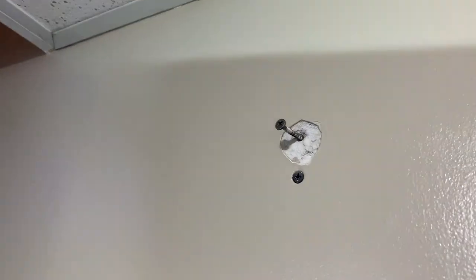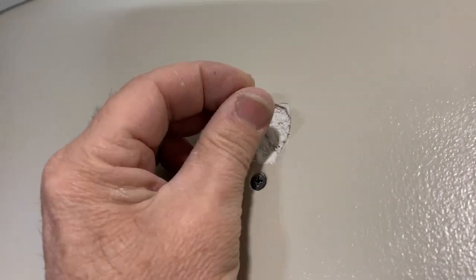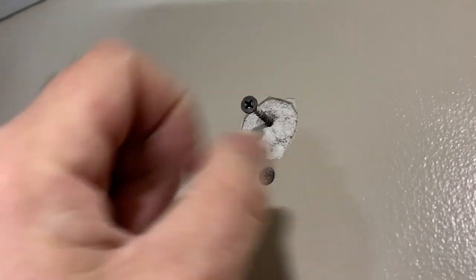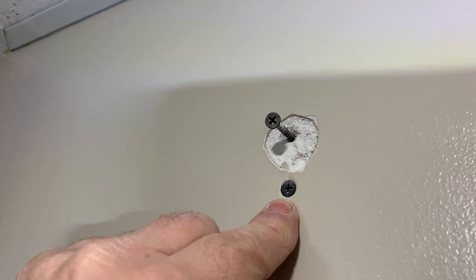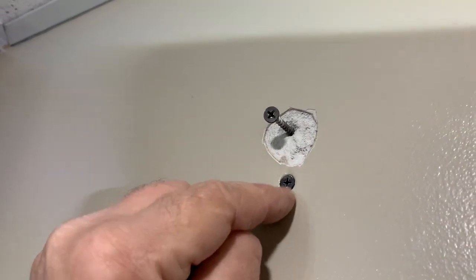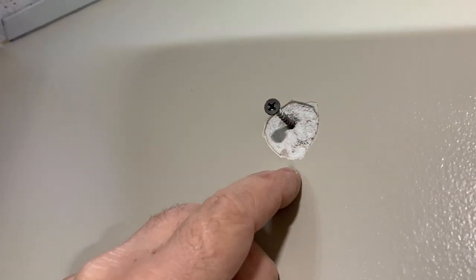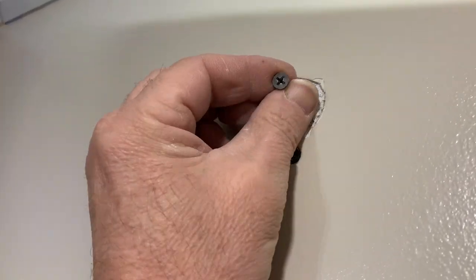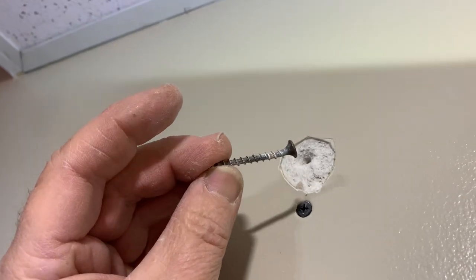Today's tip is the quickest and easiest way to fix a screw or a nail pop. What I had here was a hammer circle — a shiny circle that looked like a quarter. I should have done this video before I cut it out, but I added a screw down here to replace what I thought was a blistered paper pop, a nail pop potentially. After I cut open the blister, I found the screw — and I found a bent screw.